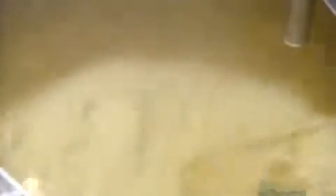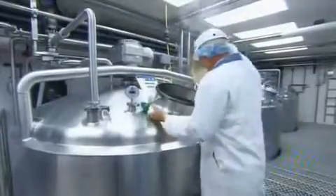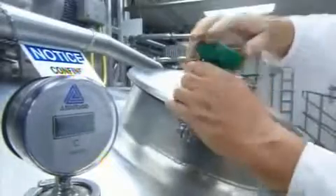The other ingredients are sugar and corn syrup. After about three minutes of mixing, a pumping system moves the mixture into large pasteurization tanks. The tanks keep the mixture at 72 degrees Celsius for half an hour, killing any bacteria and activating the stabilizers. Then the factory homogenizes the mixture, a process that breaks up the fat globules, giving the ice cream a smooth texture.